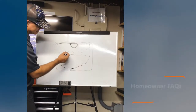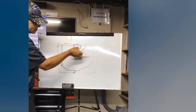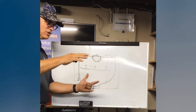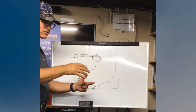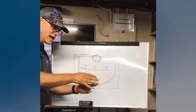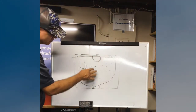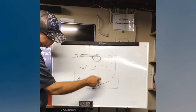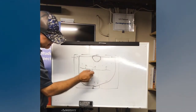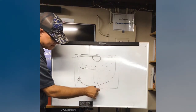As water presses up against the top, the same volume of air that was there before is now jammed up at the top and is pressurized. The best way to explain this is like squeezing a balloon — under normal situations it blows out air gradually, but if you squeeze it down first, it forces the air out very quickly. That's exactly what happens here: the cylinder comes down, tapping off where the water can exit, and when you trip it, it raises and allows that pressurized air to force the water with velocity down out of the tank and into the bowl.